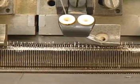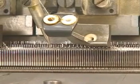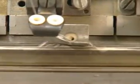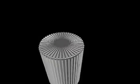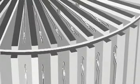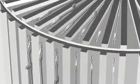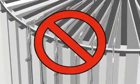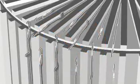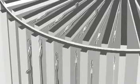A second type of gating, where needles are placed opposite each other, is interlock gating. This results in different performance. In interlock gating, cylinder and dial needles are spaced so they're directly opposed. To prevent needles from hitting each other during the knitting cycle, opposing needles are not selected at the same time. When needle 1 in the cylinder is knitting, the corresponding needle 1 in the dial must rest.